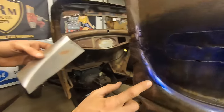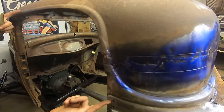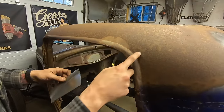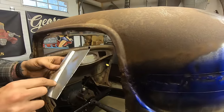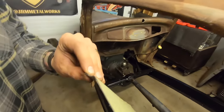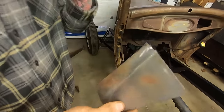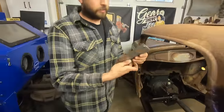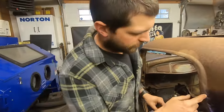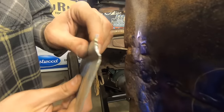to this profile. I have another one of these whole roof sections from here to here that I'll pull this bead off of, probably over here, because I don't think that's deep enough. This is a Brookville piece, and I'm not sure how accurately deep they do the beads, so I want to make it as accurate as possible to original, so I'll probably make another die, send this through quick, just to make sure it's deep enough, because I know this is all built up and stuff, but it looks like it'd be a lot deeper than that, especially up here.